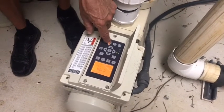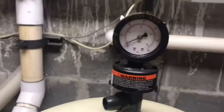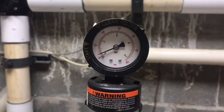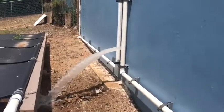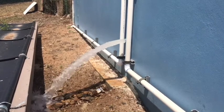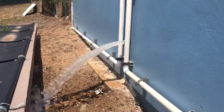When you hit the button, hit number two and she should start up. We're going to check our pressure every time we do that. When backwashing, your pressure should go down to the lower number. So we're looking good — it's working. We're going to run about 30 seconds on the backwash, then rinse, then run the backwash again for another 30 seconds on both, to make sure the filter is good and clean.